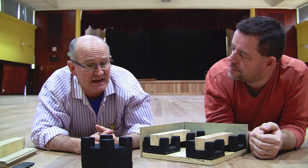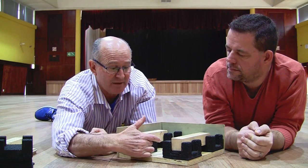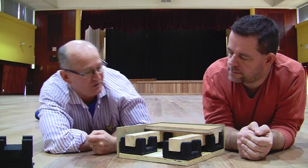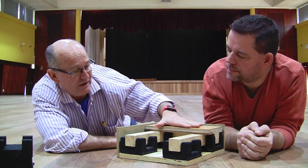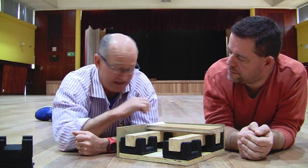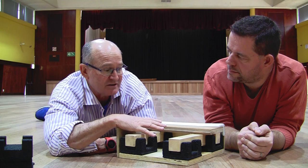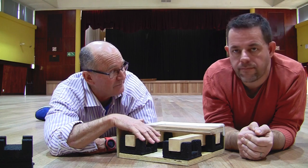Back to our system: we've got the cradles down, the micro-leveling shims in, and the battens in. We then put our floor covering on — in this case just an engineered board as a sample, which is going to be our finished floor covering. What the system allows us to do, once we've left the expansion gaps, is insulate it. We are able to absolutely separate the flooring surface from the adjoining structure, and this is what assists in limiting the transfer of impact noise through a building.